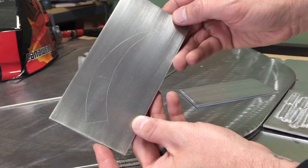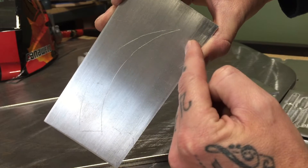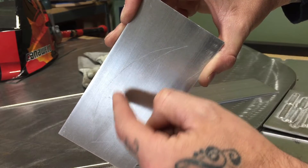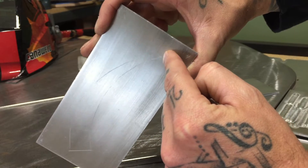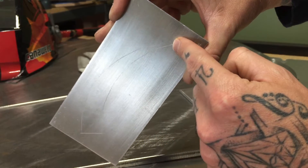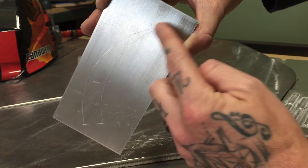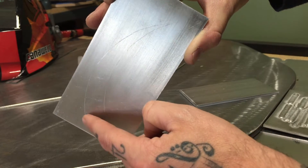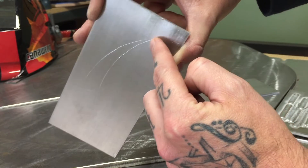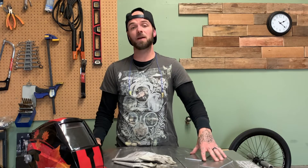This second plate is another fun one, especially when I'm warming up for an art piece. I've scribed a pattern — it's kind of like a dinosaur claw. You're gonna be welding from thick to thin: a wider weld path at the top using a weave pattern, stopping somewhere in the middle, then welding out and finishing at low amperage towards the edge of the plate with a nice cool single-step pass. You'll probably do a three-step to start, switch down to about two steps, then adjust to single step, and finish off with a nice clean thin finish.